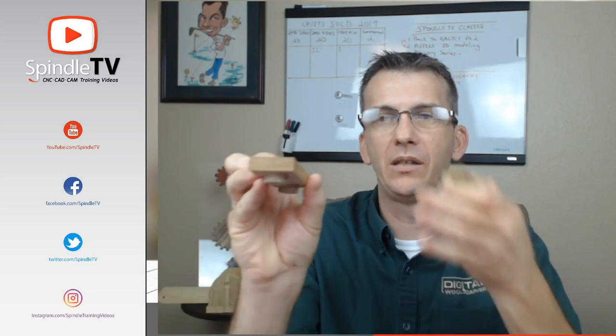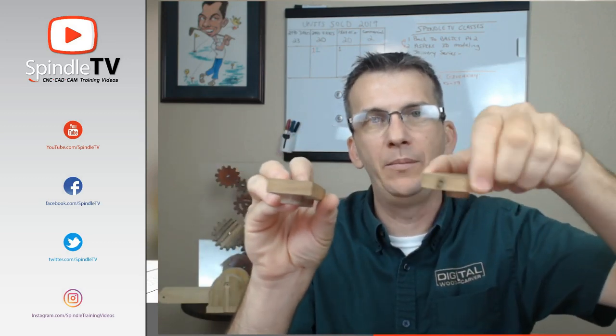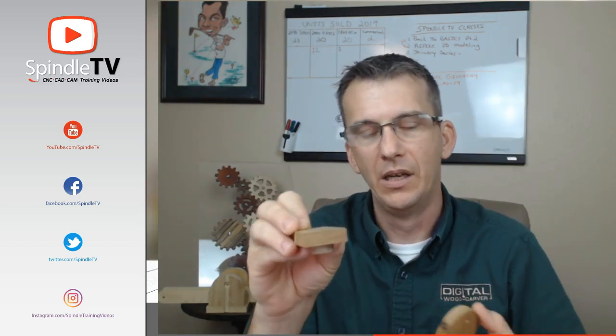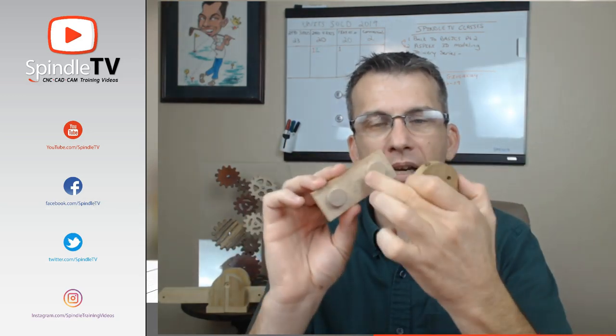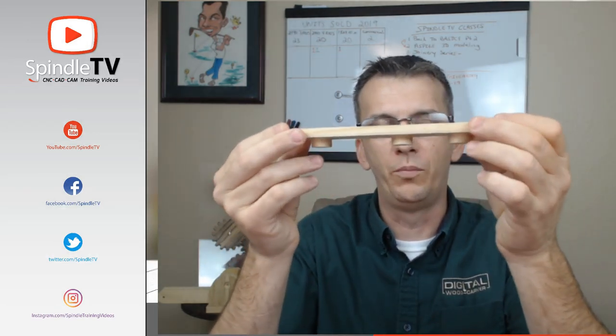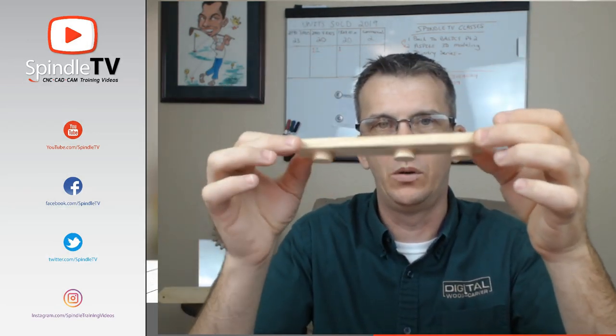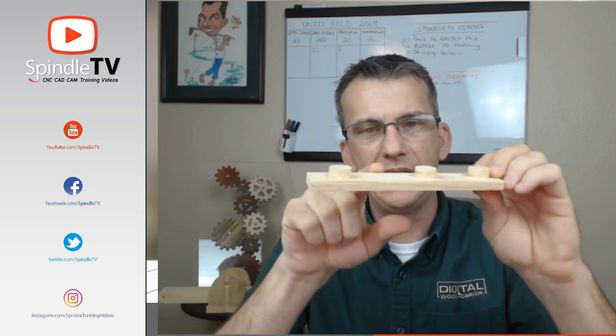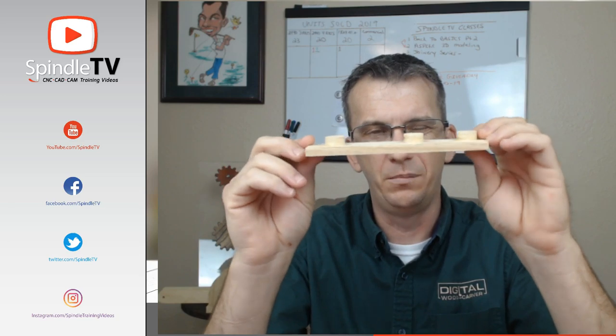So you have a fence, you have your piece, and then you have your cam that locks that piece up against the fences. These pegs are carved right out of the material to fit right into the wasteboard. So we'll talk about that as well. I also have other fences, and we're going to talk about those. This is a low profile fence that snaps into the holes on the wasteboard for referencing material off of. And you'll notice that there's a peg missing there, and that's by design.